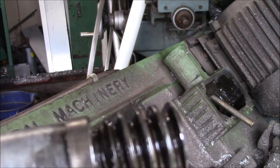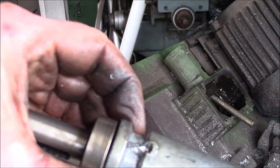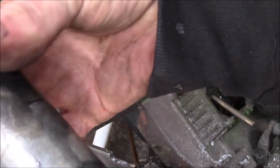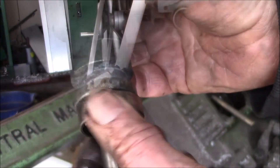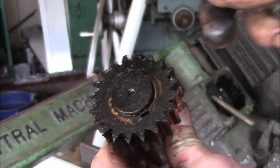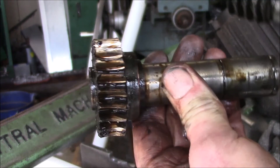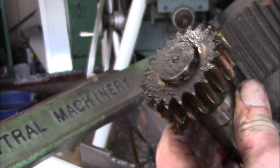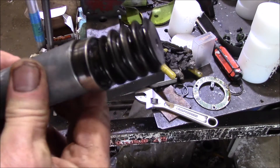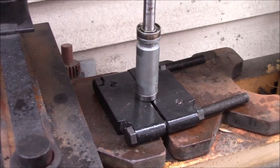The gear is okay — it's got a little bit of wear, that right side is tapered a little bit. That busted set screw kind of buggered up the spacer. This bearing is kind of crunchy feeling, but this one seems okay. It's worn for sure, but still serviceable; the teeth are pretty sharp. I might try to order the new gear — they have a steel gear now; they say the brass gear is obsolete, at least on the Grizzly page. This is a Harbor Freight saw but they're identical, same part numbers. Ran this through the parts washer and once I got the oil out I think I found the problem — this bottom bearing is shot.